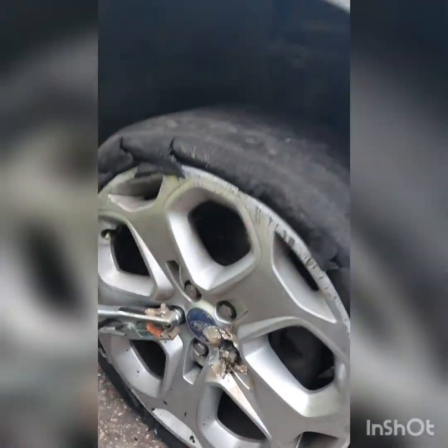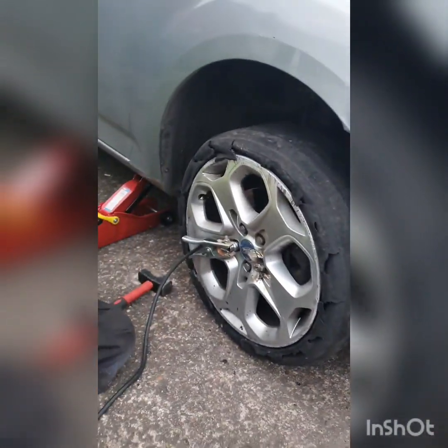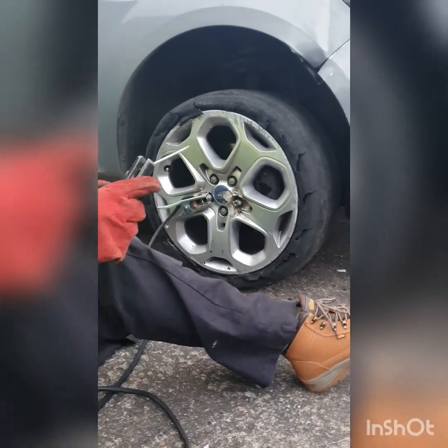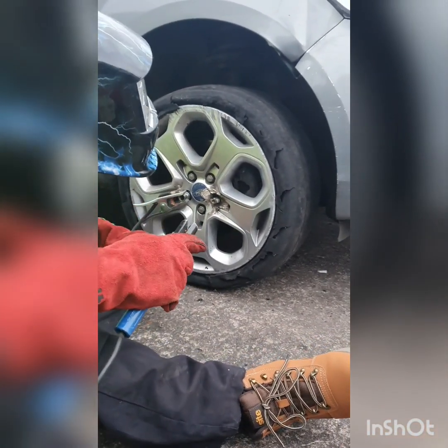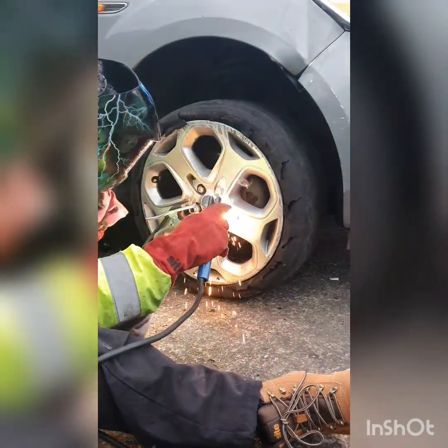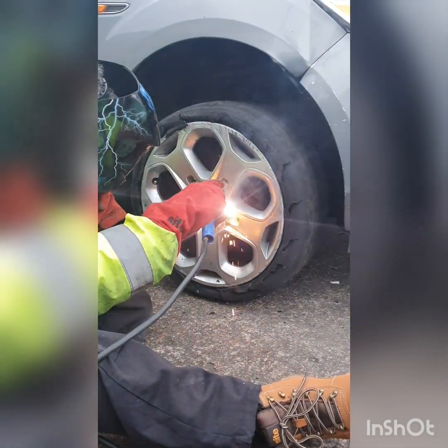You took the bar off so I couldn't see properly, but yeah, while the bar was on it did look straight. That looks better, doesn't it? Yeah, that does look straight. Yeah, 100% — it doesn't have to be perfect, but it's just so you get that angle right. Okay, now I'm happy that it's at a 90-degree angle — I'm just going to weld it all the way around.